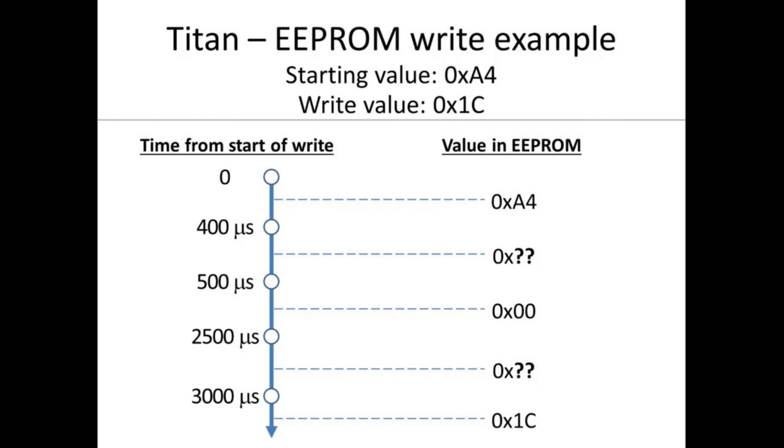And the reason this works is because in EEPROM, in Flash, before you can write a new value to a destination that already has a value, you need to erase that destination byte. And on the STM8, a little unusually, the erase value is zero. Oftentimes in other EEPROMs and flashes, it'll be FF. But in the STM8, it's zero. And moreover, the lock firmware appears to treat zero as a valid value. So all we need to do is kill power to the MCU between 500 microseconds and 2.5 milliseconds after the write to that incorrect attempt counter starts.